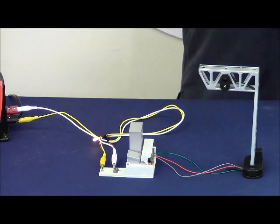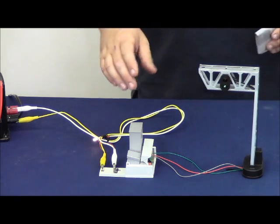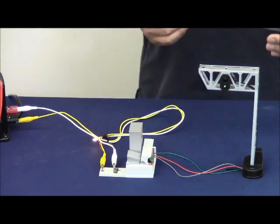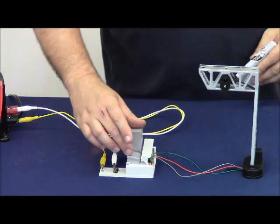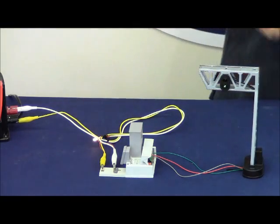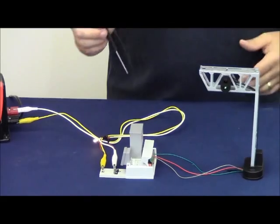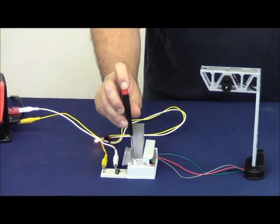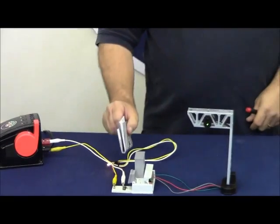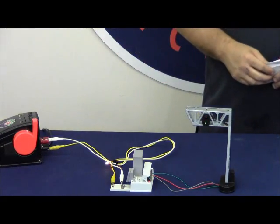If we want to increase the time on this, meaning train goes by, this is only one single point, so if we're trying to cover a long distance, we need a delay. Well, there's a delay built into the 153IR right underneath this hatch. Be careful though, because that timer's pretty sensitive. Only go very small increments at a time. So we'll make a small adjustment, and you can see the reflection is gone.